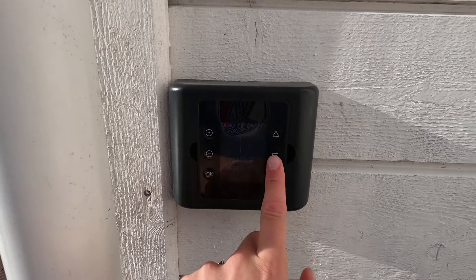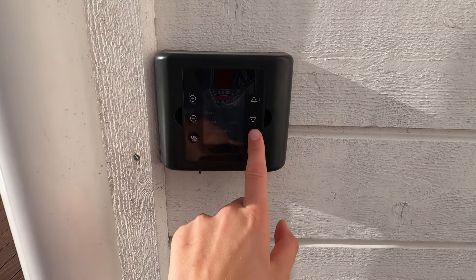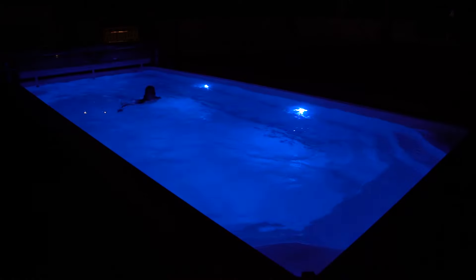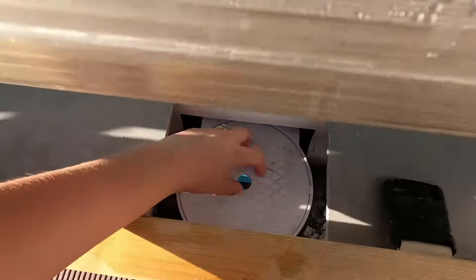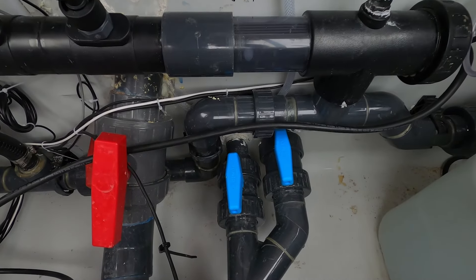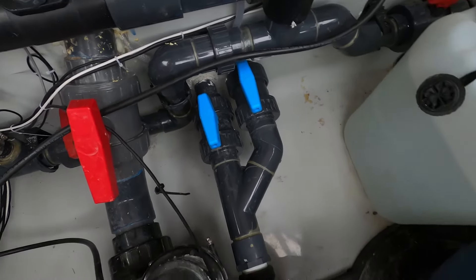The pool automation starts with the remote display for our Sugar Valley Aqua Xenic, which is the heart for all automation and control. The remote display allows management of everything related to the Aqua Xenic water treatment such as pH levels, redox, salinity, and more, while also allowing external auxiliary connections to pool lights, pool cover, UVC, heat pump, pump flow, and much more. The water treatment starts with the skimmers, where floating debris from the surface is pulled into the skimmer basket and water flows past and continues into the technical room. Since we have one skimmer on each side, we equipped one PVC ball valve for each skimmer, allowing us to close one or both for performing repairs.